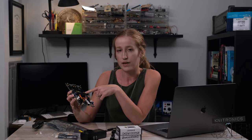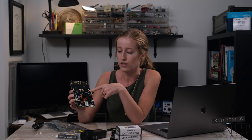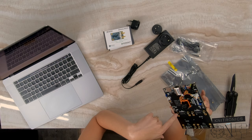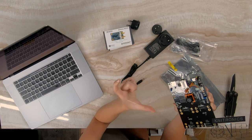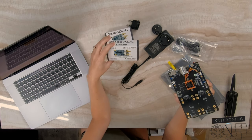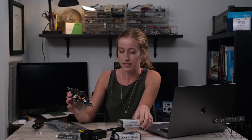Typically you'll see this on some of the higher-end boards as an FMC connector. However, these connectors are a little bit more cost-effective — smaller footprint than an FMC. I'd say this is probably about a quarter to a fifth of the size of what you'd have of your standard FMC connector. And that is what allows you the 100 mega sample per second clock rate out of the ZMOD ADCs.